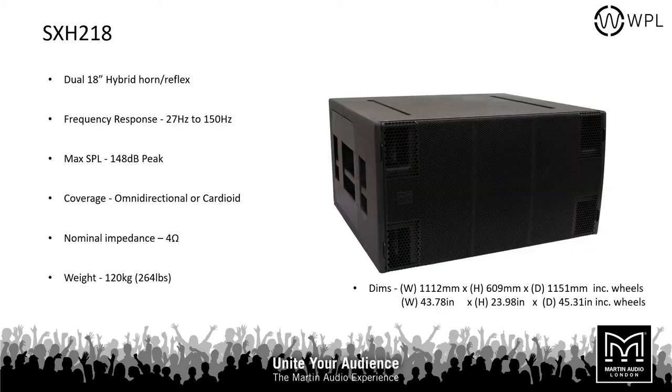WPL is partnered with the SXH218 subwoofer. This is a dual 18-inch hybrid device, so horn loaded in front, reflex loaded behind the drivers again, with a massive maximum SPL capability of 148 dB peak when it's driven from a bridged pair of IK42 amplifier channels. It can be built in omnidirectional or cardioid arrays. Each box has a nominal impedance of 4 ohms. So that's both drivers connected in parallel across the amplifier output terminals. Weight is 120 kilos.